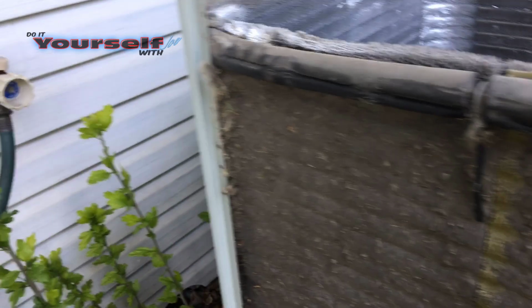It doesn't take much to get your AC ready for summer. The most important thing is cleanliness. Make sure the outside unit is clean. A dirty condensing unit will make your AC work harder, and if super dirty, will cause it to stop cooling.